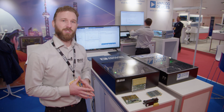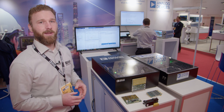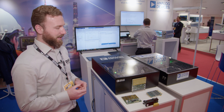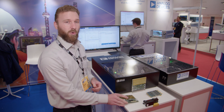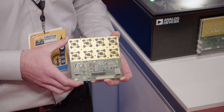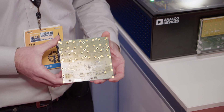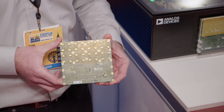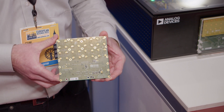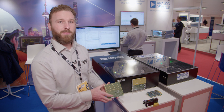What we're showcasing today in this demonstrator platform is a 32-channel hybrid beamforming phased array radar that consists of our Stingray board and the ADAR-1000 EVAL-1Z beamforming IC prototyping board. The Stingray board offers a 10 gigahertz lattice spacing direct connect 8x4 planar array to be connected to the prototyping board.